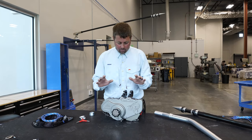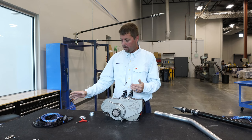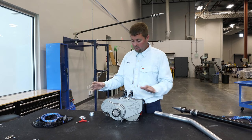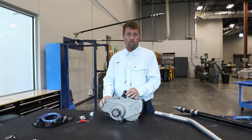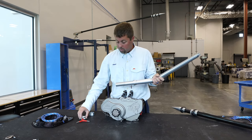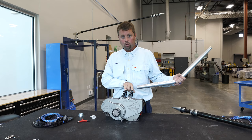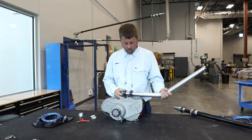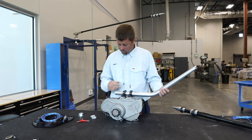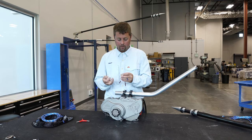Alright, so we're out here in the warehouse. We've unboxed our LP reel. I want to show you how to get the rod butt mounted on the reel, a few things about the rigging kit, and then we're going to put it over on the test stand to show you how to rig up the boom. First, take the rod butt — we took the two collars off and the reel seat off the butt. Make sure these two brackets are loose enough that you can slide the reel seat up and just eyeball it to make sure you have it centered on top of the reel. Then we're going to slide the reel seat back on and then the two locking rings back on.